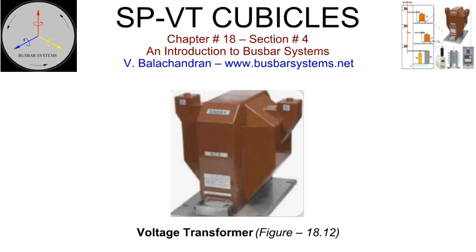Few accept a lower rupturing capacity for operation in conjunction with the current limiting resistors. A majority of the specifications do not recommend fuses for protection on the primary side of the voltage transformers. As mentioned earlier, the fuses are not expected to encounter the rated prospective fault current under practical conditions. The user may explore the possibility of incorporating a fuse of lower rupturing capacity that is readily available.